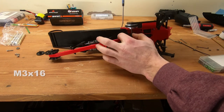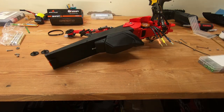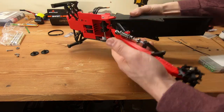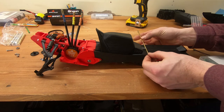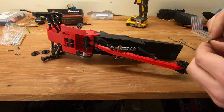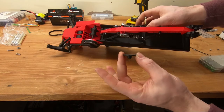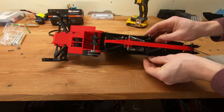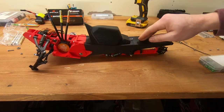Install the front swing with two screws — this also gives a lot of strength to the frame. Make sure everything is working properly, then do the same thing for the top wheels. When you install the wheels, make sure the small shaft piece is towards the outside running against the tunnel. And just like that — working suspension.